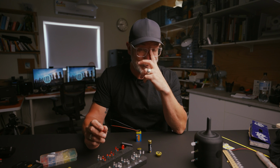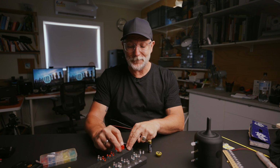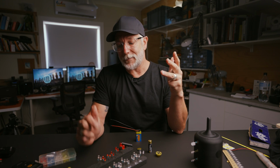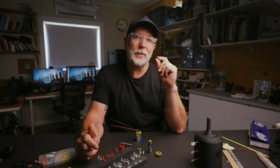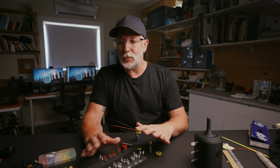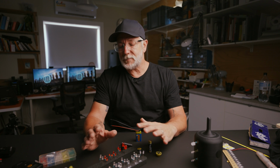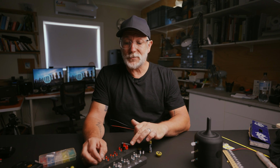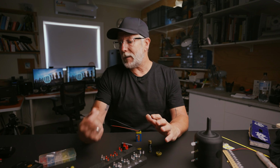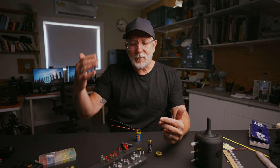But believe it or not, this is how I have done it for 15 years, and it's still how I do it. I fundamentally use 3 different values of resistance: 150 ohm, 330 ohm, and 560 ohm, and on occasion 1K, and I'll show you in a minute how that works. And then I fire up an LED, and there's all sorts of different strengths and where I get them from, and new and old, and all sorts of different types of LEDs. And I just do experiments. So I'll take an LED and I'll put a 330 ohm resistor on there, and I'll have a look at that, and I'll look at the power, and if I'm happy with it, I just continue on. And over time, I've got pretty used to it.